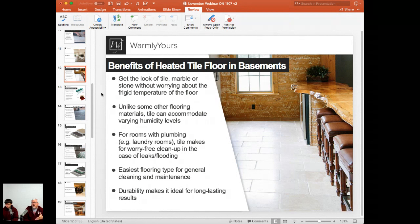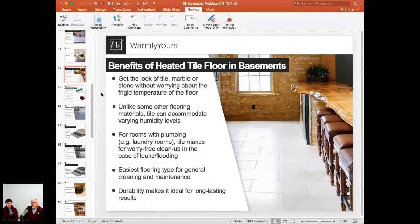We're talking like a temporary flood. Let's say it floods and you get a big pool there, like a 10-foot puddle, and you go down there an hour later and clean it up. That's probably not going to ruin the construction of your floor. But if this floor is underwater for 6 months, the makeup of that floor is going to be compromised. And if that flooring fails, if that subfloor fails, that failure will take the wire with it.